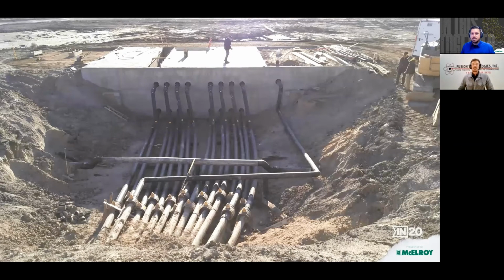future projects because of its capability. Now, we've looked at jobs like smaller diameter, like 3-inch, which we want to hydraulically fuse and be able to data log. We want to data log everything. So that's going to replace electrofusion couplings, and we're going to use it for a lot of that. So there's more of a push to be able to data log even the really small diameter, and having the joint report is becoming more and more important each day for the project engineers and project owners.